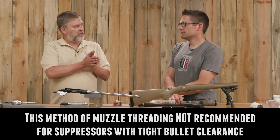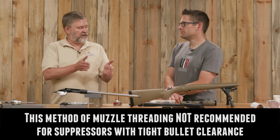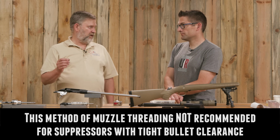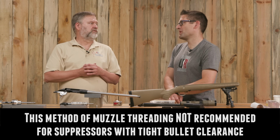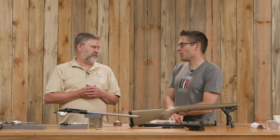Another reason that you might get a little bit of an offset like that would be if the bore isn't completely concentric to the exterior of the barrel, and that is very common with pre-turned barrels. And barrel quality has a huge influence, in my experience, on what the OD to bore runout ratio is. I mean, all over the place.